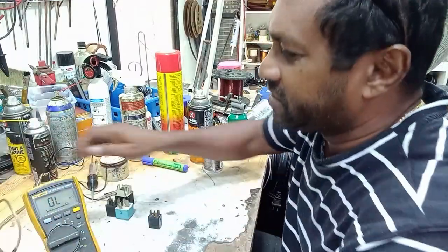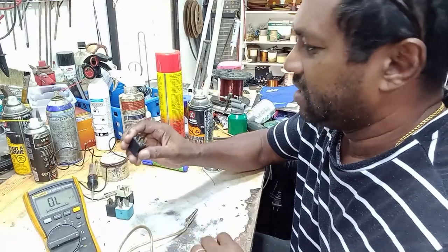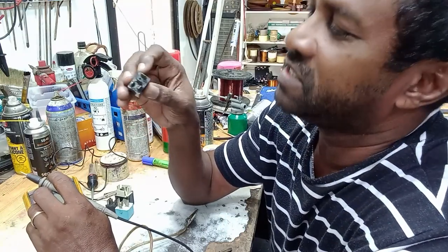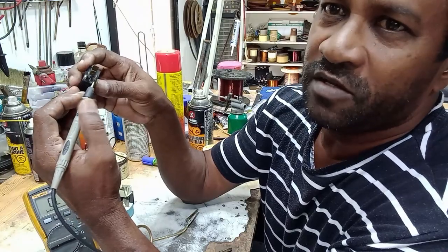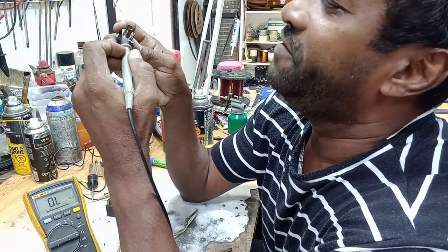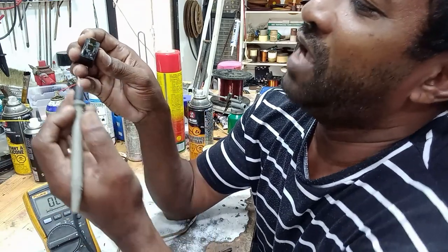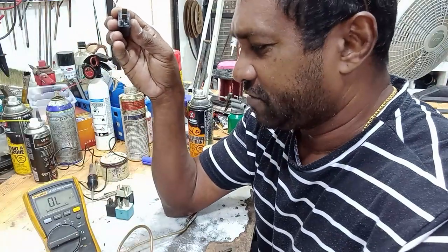I already have a 12-volt setup, so let me show you how to identify a four-pin relay. From all my experience testing these relays, the coil is usually the two tiniest or smallest pins, and they would most likely be facing each other. For example, you can see we have two little ones and two big ones — I would say these two small ones are the coil, and these two big ones are for current transfer.